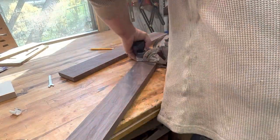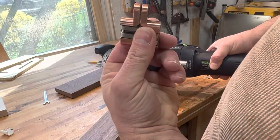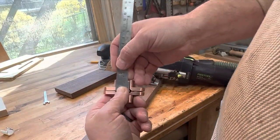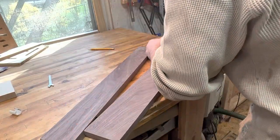For each hinge I need to make a series of cuts twice. The first series of cuts are set to a three-quarter inch wood thickness, and I also set the Domino depth to 20 millimeters because the hinge is 18 millimeters deep. At this point I'm only making holes that are wide enough for the deepest part of the hinge.